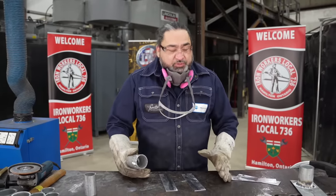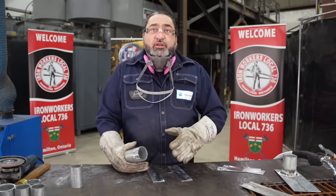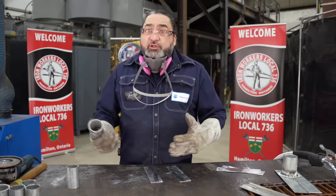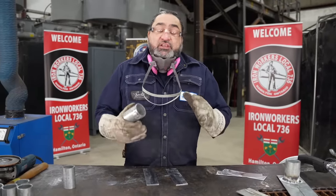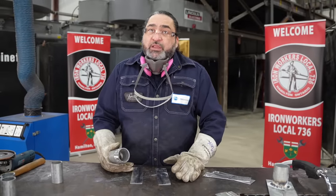Even with the prep, the prep is for welding quality. In terms of safety — full respirators, fresh air — you want to have some type of makeup air unit, whatever you need, with safety first. Always expect there to be some zinc in the air, and make sure that even with the proper prepping, you take every safety precaution you can.